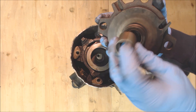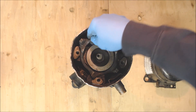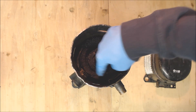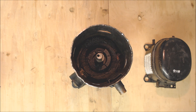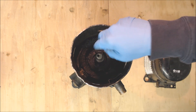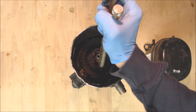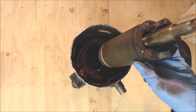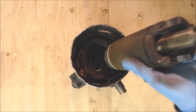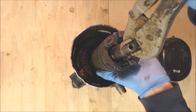This is the sleeve that fits right over the rotor shaft right here. As you can see, everything's all black in here — this is a burnout compressor. Vapor refrigerant is actually in the same area as the electrical windings. And there you have your wheel, then it shoots it through that hole up on the top and brings it up to the scroll part of the compressor.